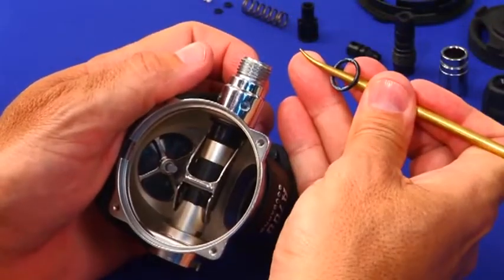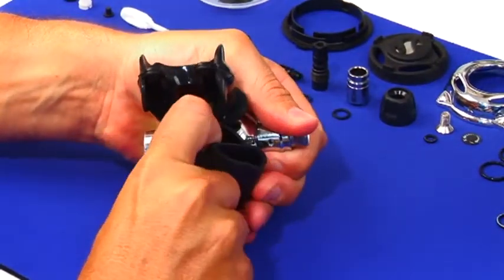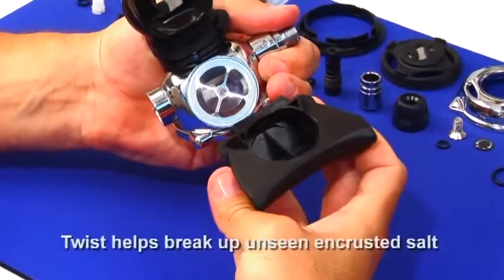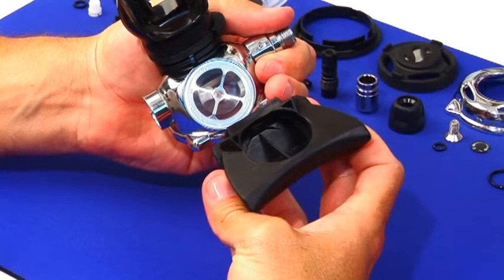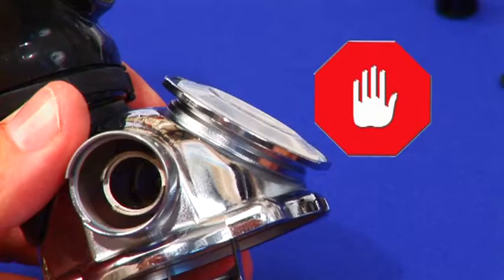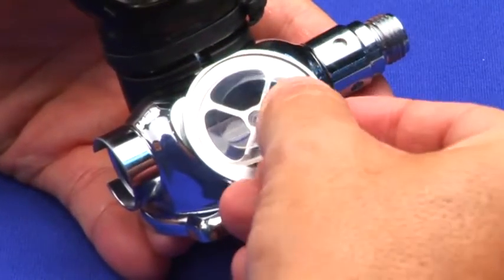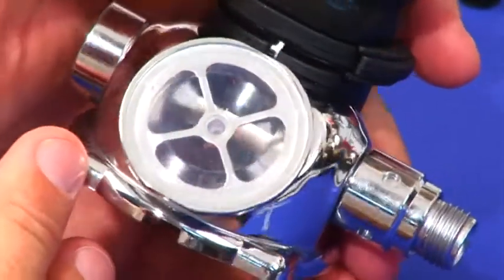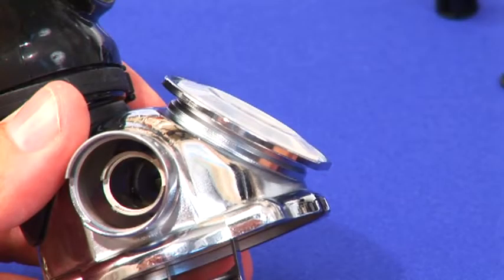Remove the inlet tube O-ring. Grasp, twist, and pull the exhaust tee free. The slight twist helps remove and or break up unseen encrusted salt. Note the position of the index finger and thumb inside the ends of the exhaust tee. The exhaust valve need not be removed. Inspect it for any signs of damage or imperfections, including insect and rodent damage. Look from the side to be sure the exhaust valve is laying flat and maintaining a good seal to the case.